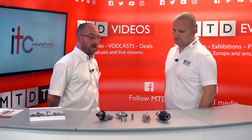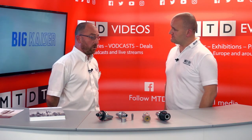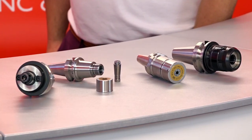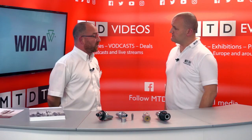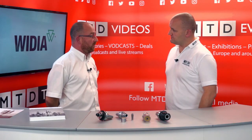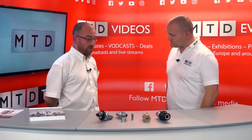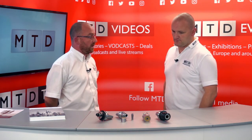To that line, we have a piece of measuring equipment on order which we're getting in November, which is a laser run out reading machine, which we can put directly into a customer's machine, feed it across on the table, and it will give a micron run out reading of what their current setup is. And I will gladly put our tools in against anybody's and prove out the 3 microns at 4 times diameter.